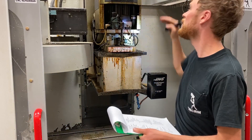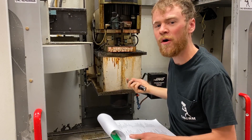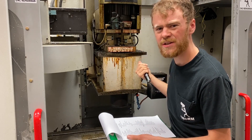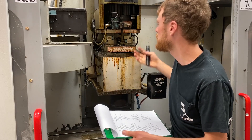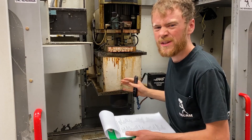Also take a look at your motor transmission. Make sure that the hydraulic lines — they're basically an oil pump that pumps oil through the transmission — are in good condition. Those lines, especially from this age of machine, get aged and they'll crack, and pretty soon all that oil is gonna be flooding down everywhere. And those are really, really hard to change.